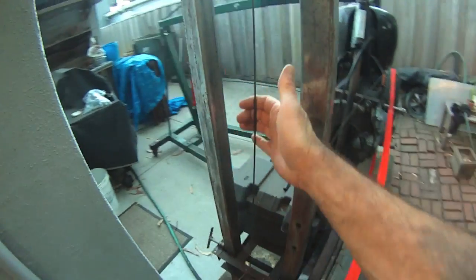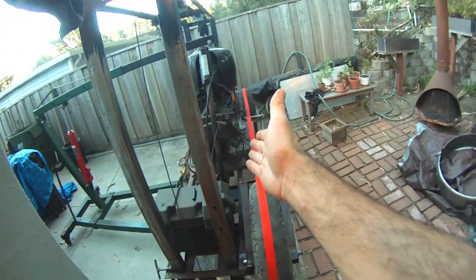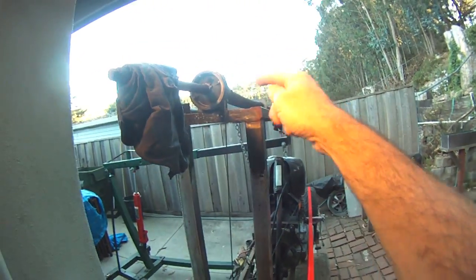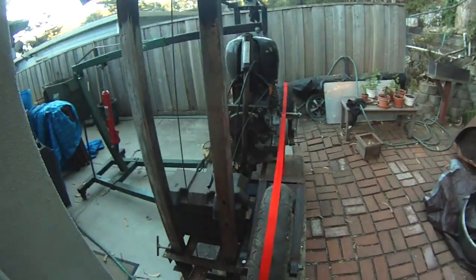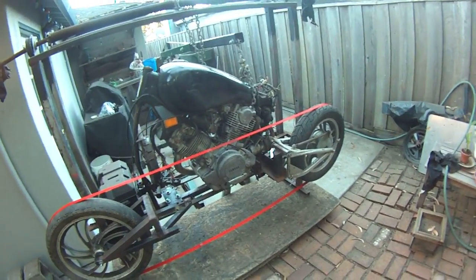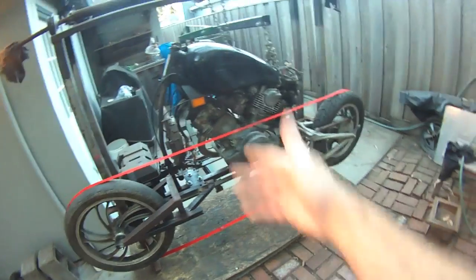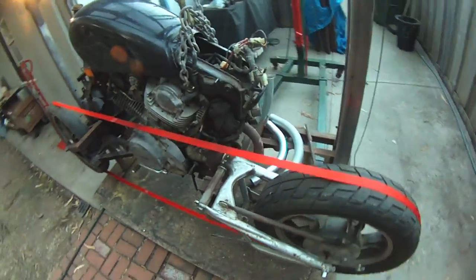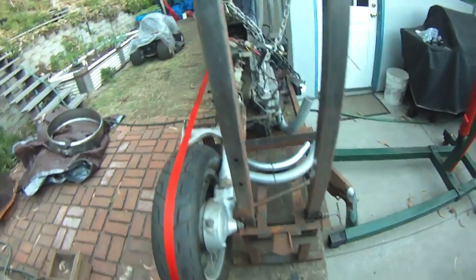It's going to use garage door springs. This is no heavier than a two-car wooden garage door, which is what these would be coming out of. A 6-inch spring could handle probably a 400-pound wooden door, and this is not going to be that. So I'll be able to use dowels, and I'm going to make this cutting tray pretty much weight neutral.